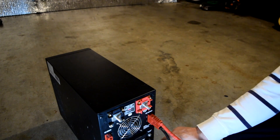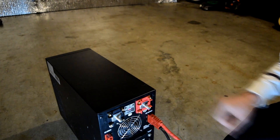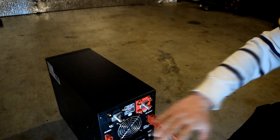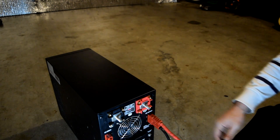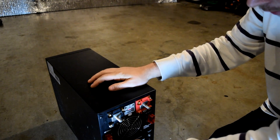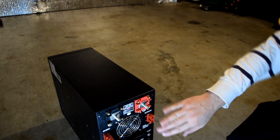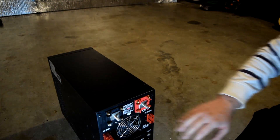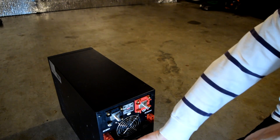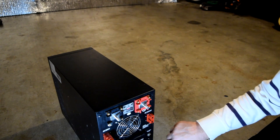You connect your 110 volt wires coming directly from the breaker panel, then connect the power output to your load. Once connected, you attach a 24 VDC battery bank — negative and positive here — along with the photovoltaic input DC output. You can also connect a separate battery bank for charging. There's a circuit breaker for leg one and a circuit breaker for leg two.